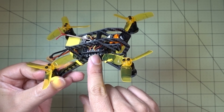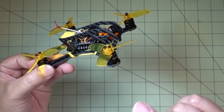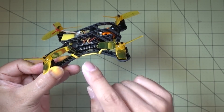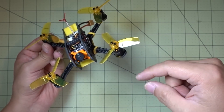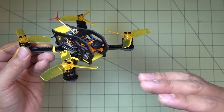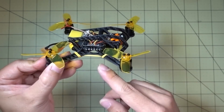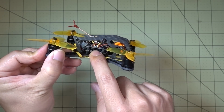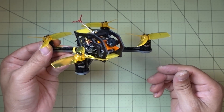In regards to the setup, I did flash the latest Betaflight 3.2 RC6 — I put a card in the corner if you want to know how to flash Betaflight 32. I also flashed the ESCs again; I put another card up if you want to know how to flash your ESCs. If you want the config for this, I'll put a CLI dump in the description. If you guys want my PIDs, I'll probably be running some pretty low P and D gains on 3S for this setup, but I'll put that down there. All you have to do is flash Betaflight 3.2 to the flight controller, flash the latest BLHeli 16.6.7 to the ESCs, and then copy my CLI dump and you'll have my setup for this drone.